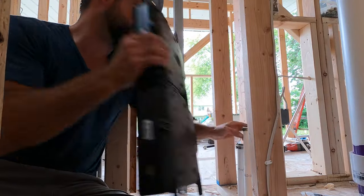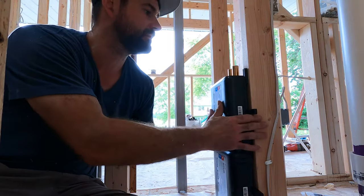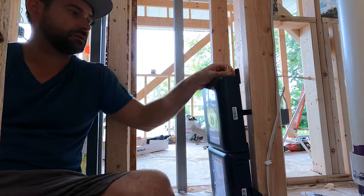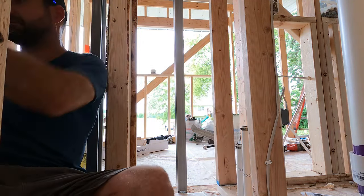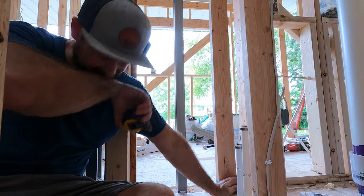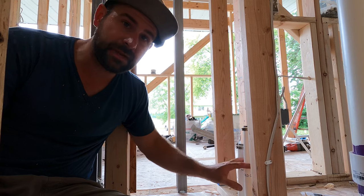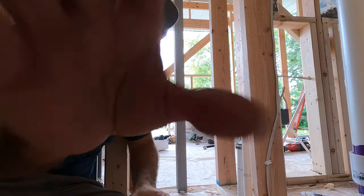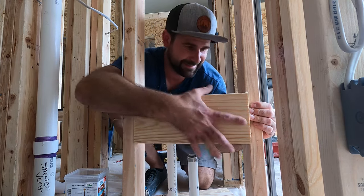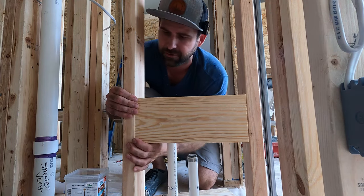I'm pretty sure I'm right on the money as far as depth in the back, but let's take a measurement of where these actually ended up. They ended up about a half inch back. These pipes make it to where — oh, that's a 2x4. So I'm going to mount some 2x4s on the back here, then cut these PEX pipes. I got some quick connectors — we're going to slam it together. I planned for something nice and solid like a 2x4 to mount this sucker to, and I made sure the pipes came up out of the floor, which was the hardest part.